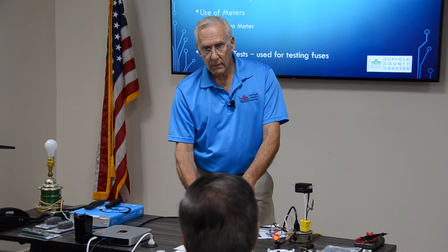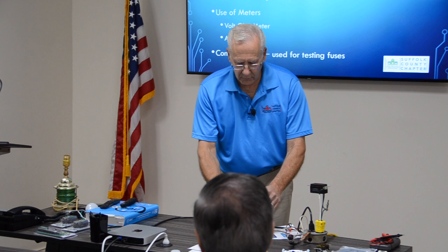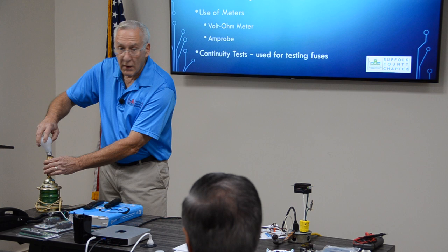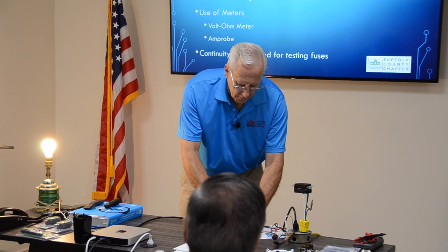Let me show you something. Take the light bulb out. What's going to happen here? Not going to get it, right? Because it's not coming back. Okay, so you understand that. So you understand the reference point. You want the reference point to be the earth. A neutral is a grounded wire. A neutral is a grounded wire in the system.